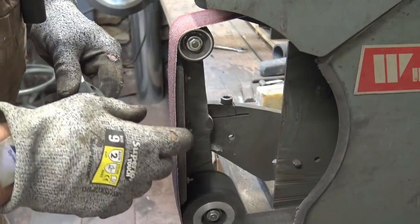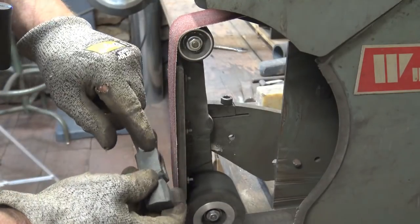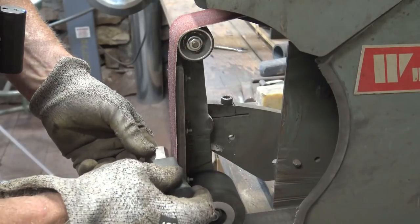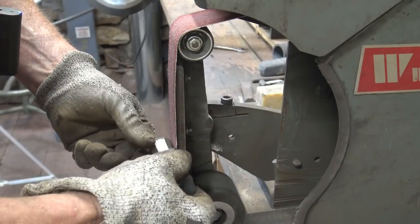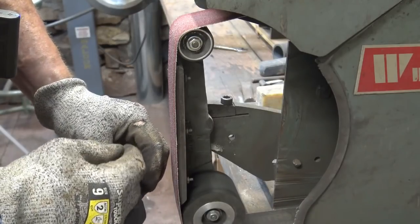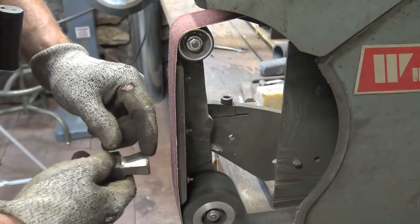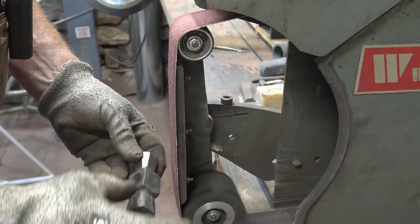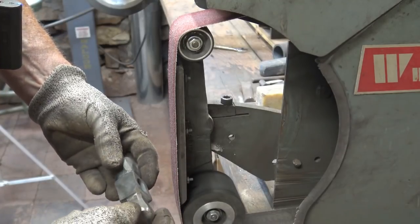We're using the flat platen of the grinder with the belt running just a little bit off the edge so I can get in real tight and end up with a nice transition where the head goes to the eye section of the hammer. I've worked just like you forge — do all the flats square and then go to the octagon. This isn't a true octagon; the flats are going to be bigger than where I've knocked the corners off, it's just a really heavy chamfer. Then I'll flatten the end and round that up a little bit, do all of that with a 60-grit belt, and then do the other end that will be rounded, then go to a finer belt to clean it up.